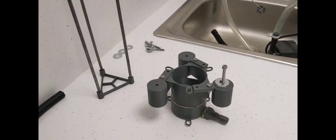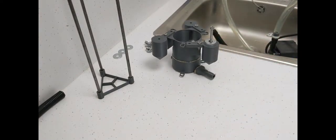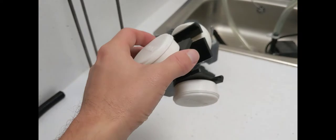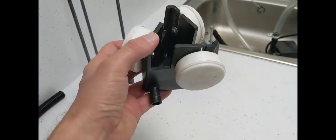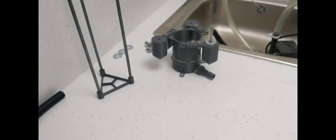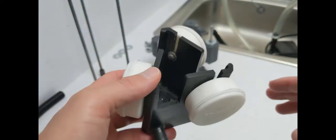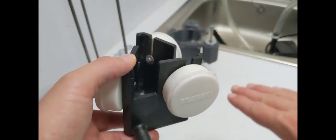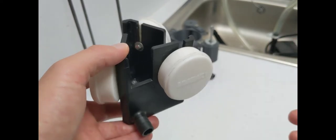I'm about to show you my redesigned coolant skimmer and how it works. First, I'll explain what a coolant skimmer does and the problem I was trying to solve. This is the existing design from a company called Abenaki — there are different makes, and this isn't a particularly good one, but even the good ones aren't really working that well. A coolant skimmer uses a waterfall/vortex effect to remove coolant, oil, and debris that floats to the surface of the coolant out of the tank.